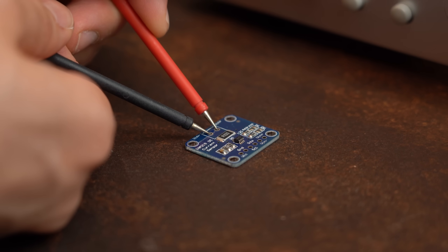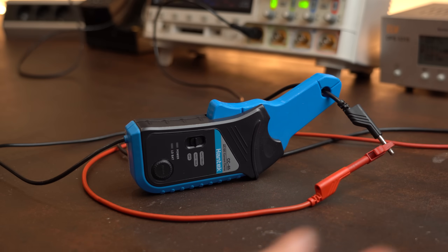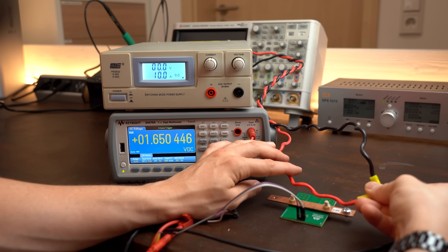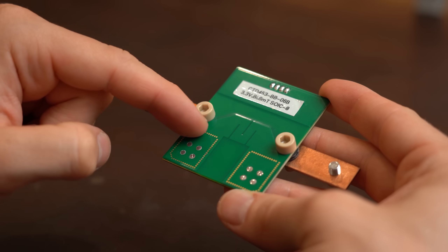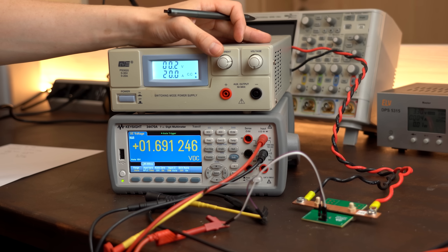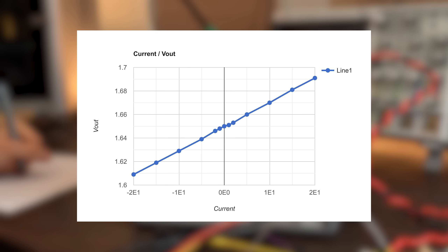When measuring current I previously used either an IC that measures the voltage drop across a low-value resistor, or a current clamp which also measures magnetic flux density. That is why the PCB comes with either PCB traces you can use, or a bus bar which does require cutting the wire. I was very happy with the test results: while pushing up to 20A next to it, the output voltage was stable, repeatable, and very linear, even when reversing the current direction.